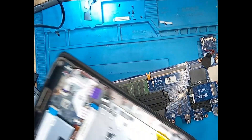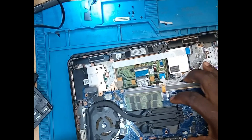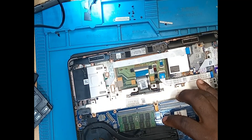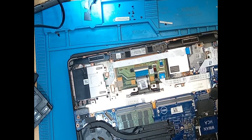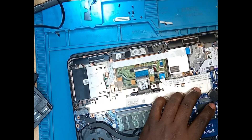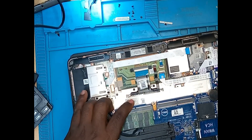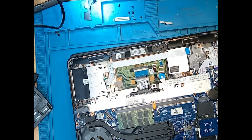Let's plug in the charger and see whether the bridge was the main reason why this laptop was not coming on — I'm suspecting that could be the only reason. The resistor must be having a voltage on it; there must be power coming through that line. And when the resistor is connected to pin number four — that is ground — that is short to ground, and the machine will not work.